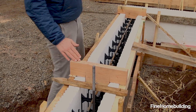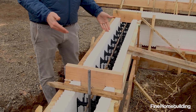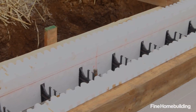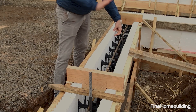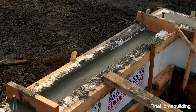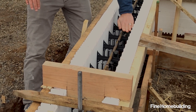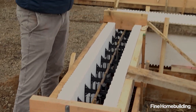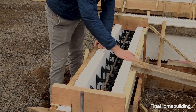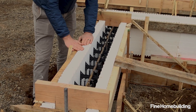Moving down the ICF form, there are two block-outs here where we took a 2x6 — this is the main entrance door to the building. Because it's a zero energy home, we want to thermally break the door threshold. We knock this out so that, following this red line, about an inch and a half down is where the concrete stops, allowing us to put foam in to break the door threshold from the concrete and eliminate energy losses through thermal bridging. This lowers the concrete about an inch and a half so we can get our foam thermal break in, set the door on top of that, and have the interior floor flush with the threshold and flush with what will eventually be a deck outside — no tripping hazards in the final building.